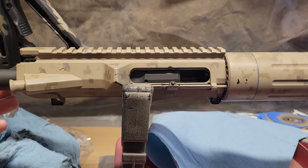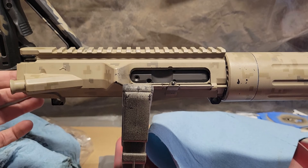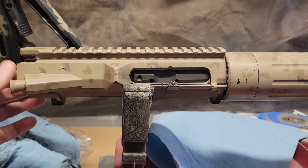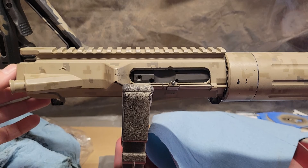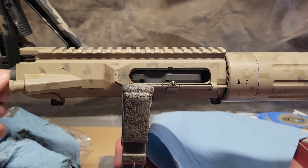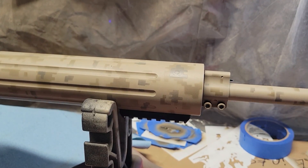I think I'm good there. I'm looking at my bore scope over there and it looks like I'm still aligned properly. So I think we're probably going to cinch it down right here. You may end up having to take it out and tweak the gas tube a little bit to get it to play nice, but in this case this is pretty good. We don't want a lot of binding and a lot of extra wear on the parts as this bolt is cycling. We want to find a nice smooth spot while still having good alignment down here at the block. We'll see you next time.